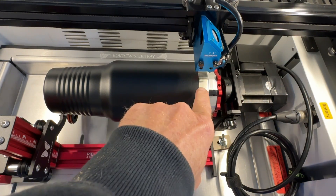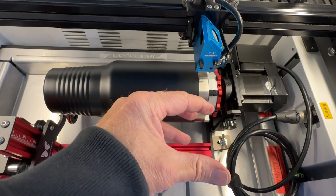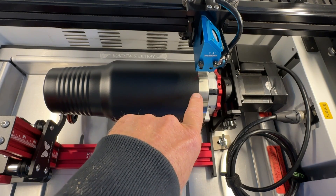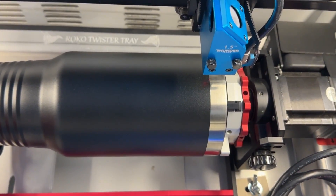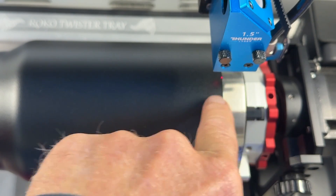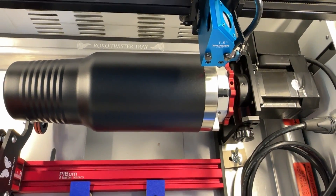Okay — more than likely your grip had moved when you plug it in. You saw that it rocked in and kind of locked in. My mark was off about two millimeters. Now we can see that our red light is right lined up with our pencil mark, and at that point I'm ready to go ahead and engrave. So next we'll go to Lightburn, lay this out, and we'll be ready to go.